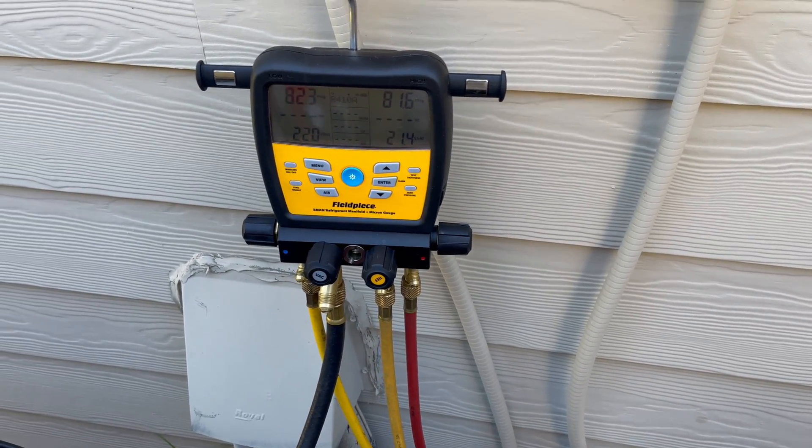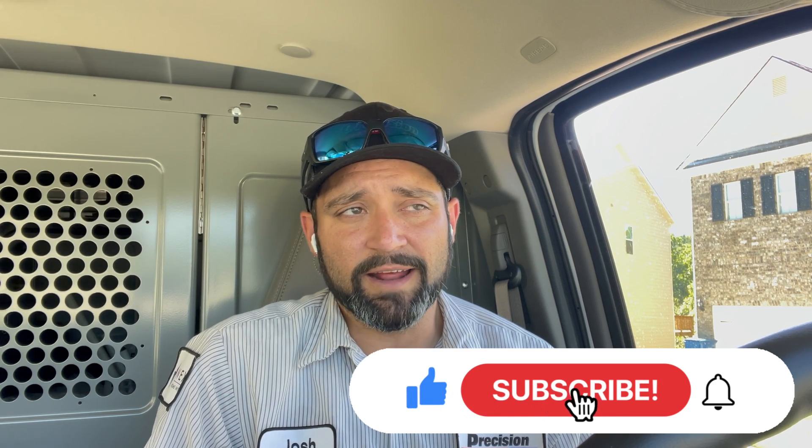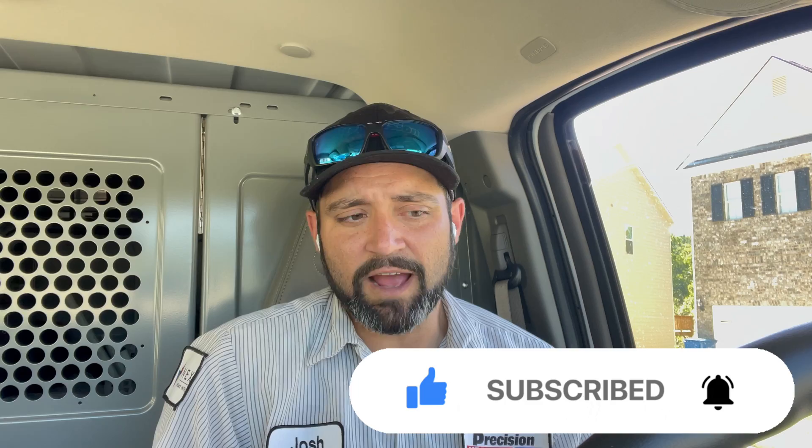I wasn't able to film that last little part, but there wasn't really much else to do. I just had to get the doors back on and reattach that bulb. The only thing I would have liked to have shown is how I always re-insulate it. I don't ever go back with that same thin insulation — I like insulating it really well. So I use the 7/8 insulation, wrap the whole bulb and the line, use a few zip ties, and sometimes I'll even tape it all the way up. I'm still waiting on the vacuum to finish. These calls take a really long time. If you're really taking your time and doing everything how it's supposed to be done — nitrogen, pulling a good vacuum — it's going to take several hours. I always give a time frame to the shop: always give me four hours on these, though sometimes I can get it done in around three.